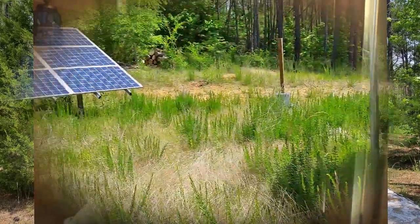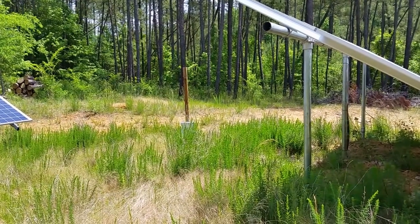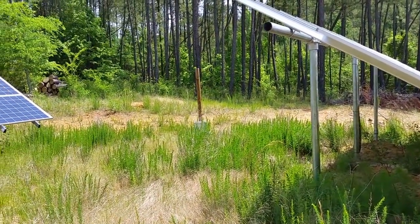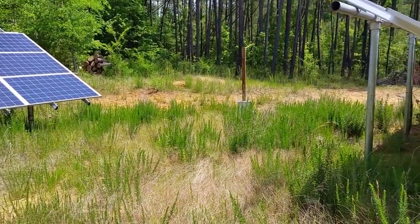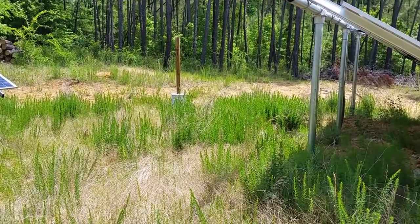So 2 junction boxes, each with 5 breakers in it, with a series of 3 solar panels hooked to each breaker. So 10 breakers total, 5 per box, and that gives you 30 solar panels basically combined into 2 sets of wires that are going up to the battery building. So the wires from each panel are going to that pole out there, and there's 2 junction boxes there. It really didn't have to do that. They did that initially because there was going to be 1 set of wires going up to the battery building, the electrical building. But then they discovered there needed to be 2 sets of wires because of how much current.